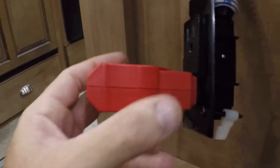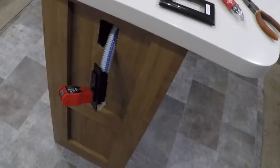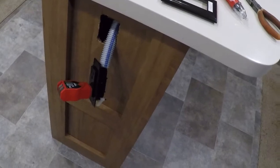you just heard that. That was the GFCI popping. So that circuit actually works, and the GFCI is actually over here. I'll reset it. There. And yeah, she's cooking again. So alright, now we know that there's no power on that, and I can work on that circuit basically safely.